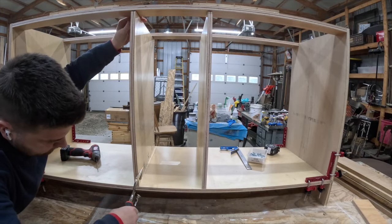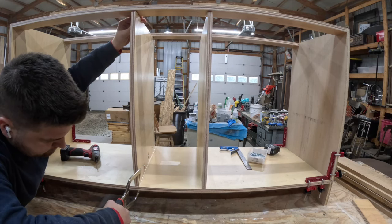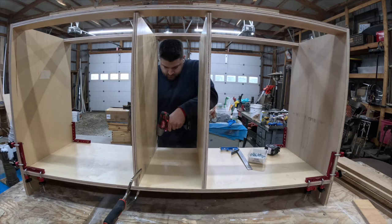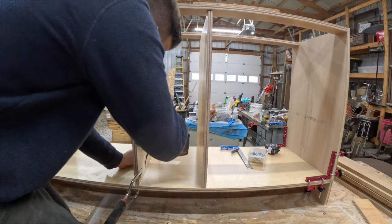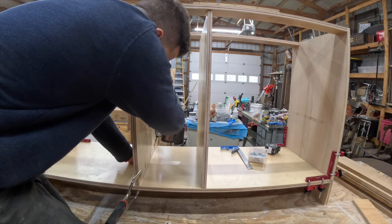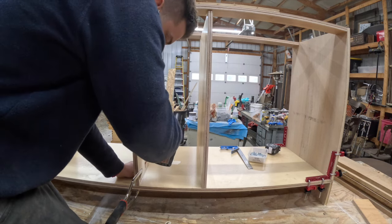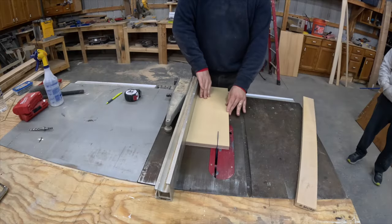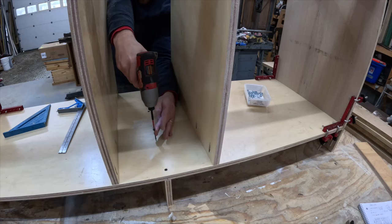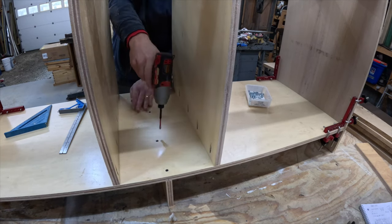With our box made and squared up, I cut the two dividers that are going to separate the two cabinet sides with the drawers down the middle. To secure these I used glue and pocket hole screws. Notice I drilled the pocket holes on the drawer side of the dividers so you don't see them when the drawers are in place — if you put them on the other sides, you'll see them when the cabinet doors are open. Given that this was a five-foot span, I also whipped up an extra leg that I put down the middle of the vanity, attached with some extra screws that you won't see when the drawers are in.